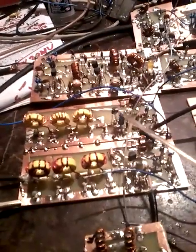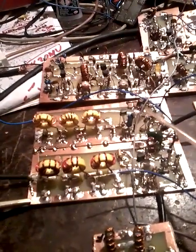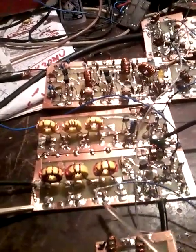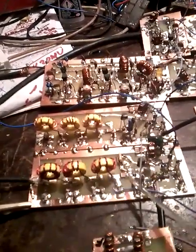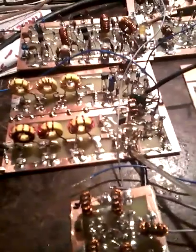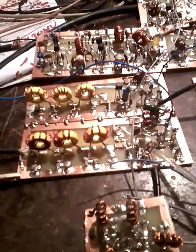One stage low-pass filter and amplifier I will use for DDS for the local oscillator for RX-TX. Another low-pass filter with one amplifier stage I will use for BFO, for USB and for LSB.